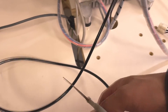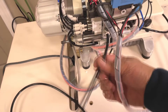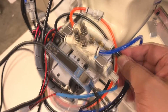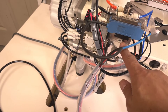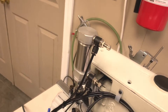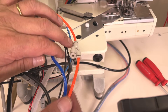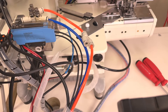This is an air pipe originally on the machine. Cut this pipe short and connect it here. You can put the air supply pipe from the compressor here — use a 6mm air pipe. This empty connection should be connected to the presser foot lift cylinder using a 4mm tube.